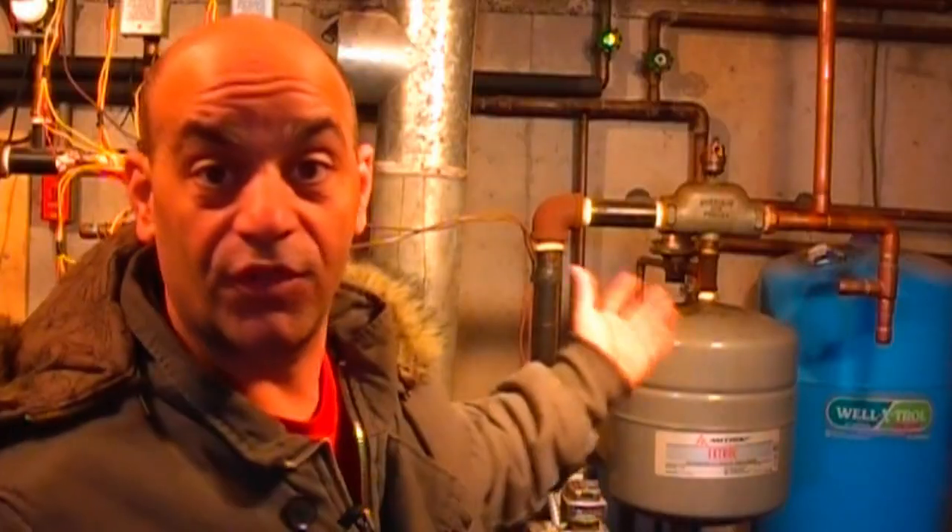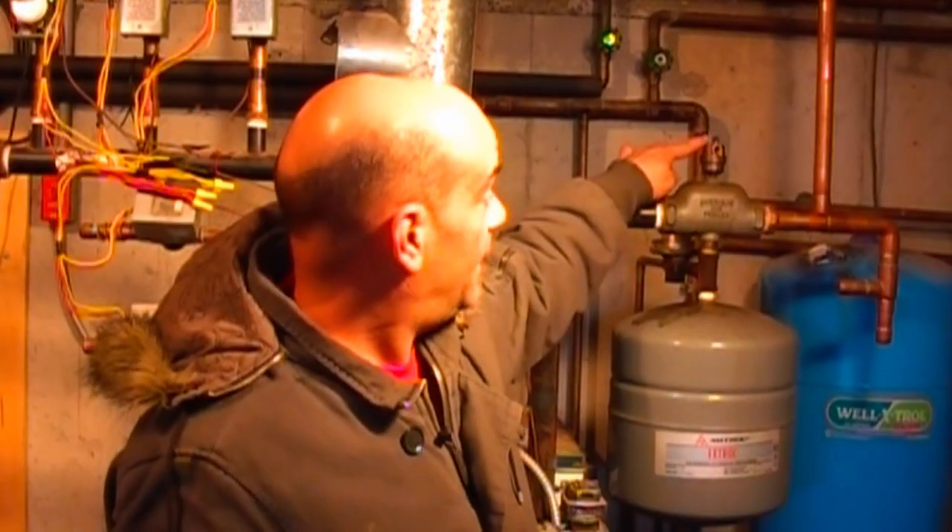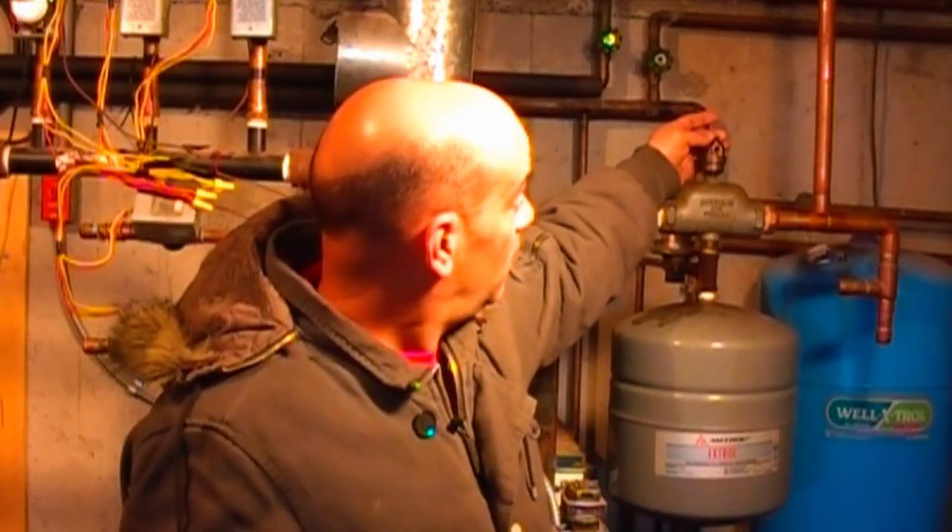This is my system that I built about 13 years ago. We have a little purge valve up here. This one is a little plastic screw, and you just leave it a little loose — you don't want to tighten that down. Most systems have a cap that looks like what you'd find on your tire, a similar little cap but with a little hole on the side. A lot of people see that it's loose and say 'oh, that's the problem' and tighten it down. Well, you just made more problems for yourself. That's supposed to be loose — it's just a cap on there. It has a little Schrader valve inside. If any air comes into the system, this purge lets the air out by itself a little at a time.